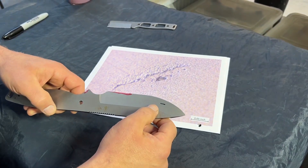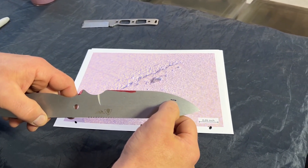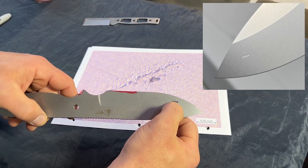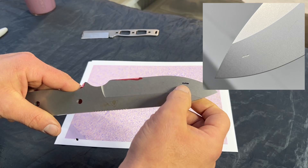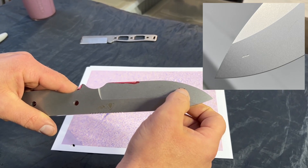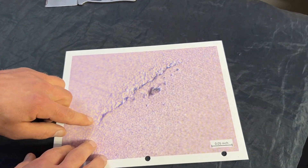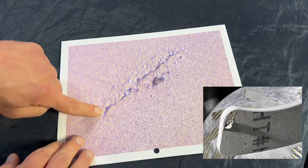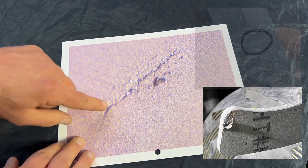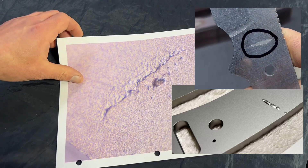As you can see in earlier videos, I've been sending some samples out to different labs where they had just a mark on them — looked like that — just in that area and some different spots on blades. But as you look closer at what looks like a crack now under the higher level of microscopy here, you can see that this is very much a delamination situation. This is going to tie into the other voids and things that I was showing in other videos and photos.